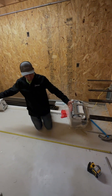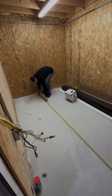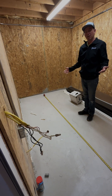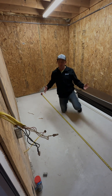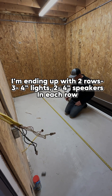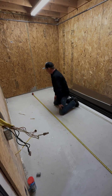Now I've roughly got where my two outside lights are going to go. Let's see what this total distance is in between — I've got 126½ inches. On bigger rooms it's going to be about 30 to 36 inches from each end, and then I try to center the lights from that middle measurement. On this one I'm going to be 63¼ because that was 126½, so I'm within that six feet that I like to be.